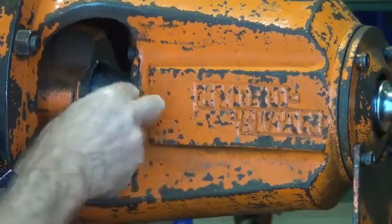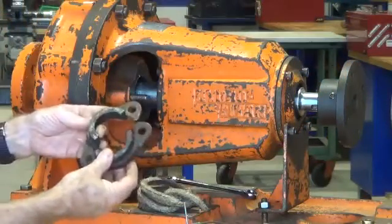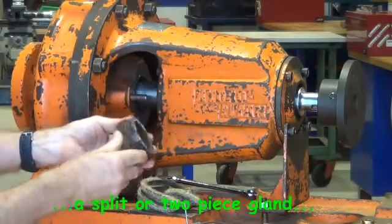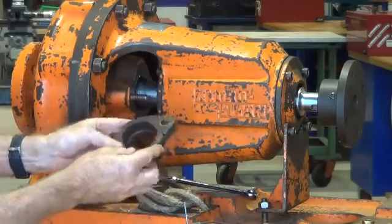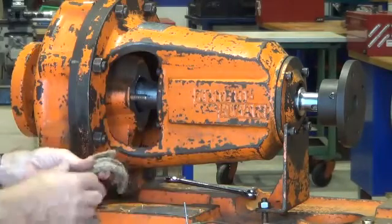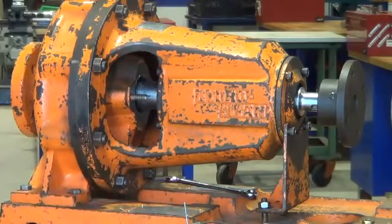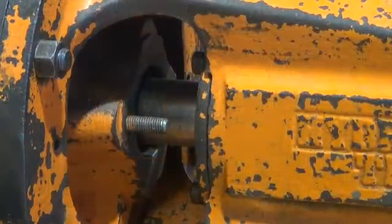Manufacturers expect a small leakage to come out through the gland, and for that reason they leave a drain hole just in the bottom of the pump. This is a two-piece or split gland, which makes it easy to wrap around the shaft in position so you don't have to strip the whole pump down to remove the gland or change the packing. It's important to count the number of rounds — in this case we've got seven out of that pump, which means at least seven new pieces and probably one more to keep the gland back from the stuffing box and allow some periodic adjustment.